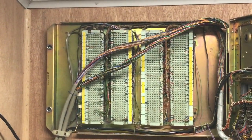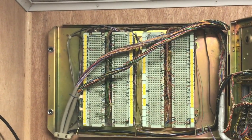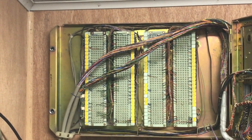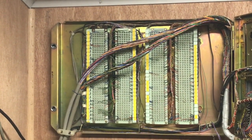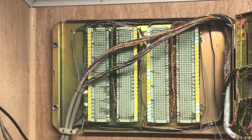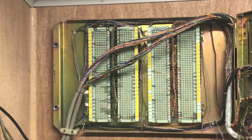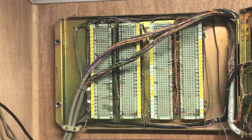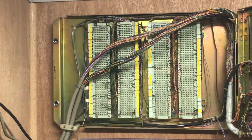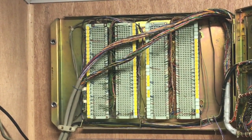This is the back plate that has the 66 blocks wired on it, and then there is a harness that goes over to the slots where the KTUs plug in. I have two 100-pair cables in here as well as two 6-pair cables for the dialtone to go into the KSU.